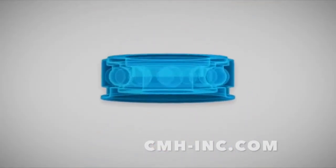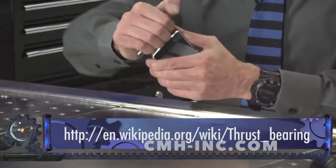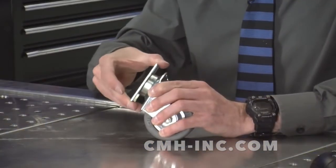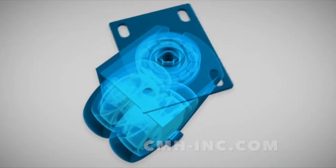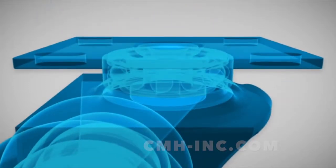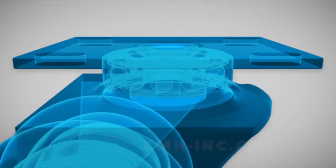When you look on this one, it's designed as a radial thrust bearing, so this, you can't peel it off. There's no play in it at all. It's absolutely rigid for that whole bearing. Like the slightest bit of movement moves everything else. And that takes a lot of work, because this has to be designed not just to twist, but to have this be levered against with 200 pounds all day long and spin around in any direction and be able to handle all of that.